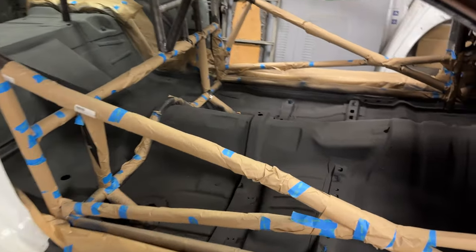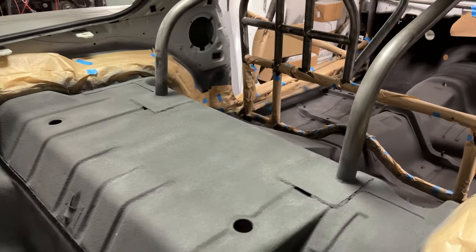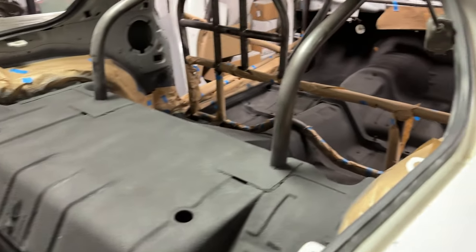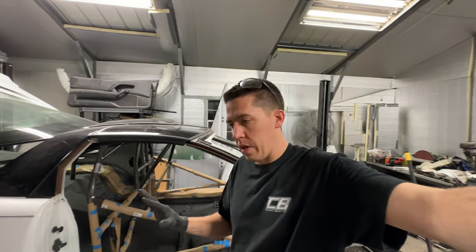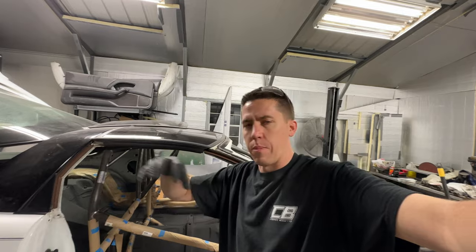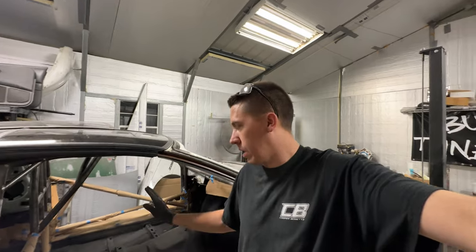I was actually able to pretty much finish up the entire thing — I think it looks pretty killer, came out really sweet. You still see a little bit of striping; hopefully that'll go away when it dries. They recommend 40 mils thick — that's two coats at 20 mils. I think I'm right around that 20 mil mark on the first coat. It's almost hard to go too thick — you start seeing it clump up and get wet in an area. It looks like it dries pretty quick, but it's super soft. You can bump it and it'll smear, but I think it looks amazing.